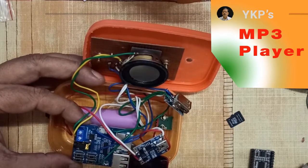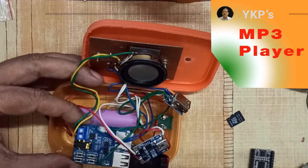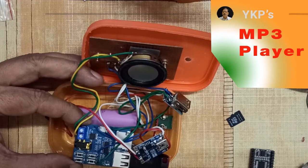And then of course I connected the speaker. This is the 5 volts coming in from this PCB. This is a 16 GB USB stick I formatted in FAT32. While saving MP3s we have to name them as 01, 02, 03, 04, 05, and so on. Then we have to save them into the USB stick one by one — first you save 01, then 02, then 03. Only then the playing order will be proper. Otherwise if you try to copy them all at once — say 5 or 10 MP3s — we are not sure in which order Windows copies them, so the playing order will not match your numbering.